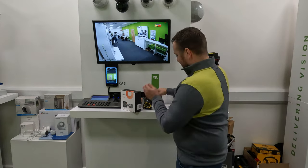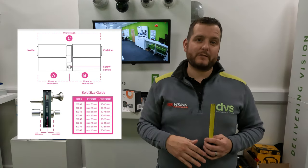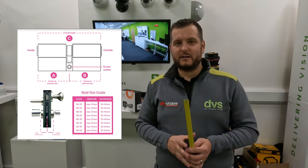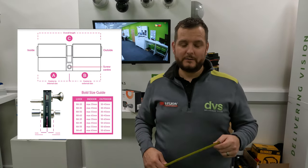The first thing you need to install this — and this is the best bit — is a screwdriver: a Phillips and a flat blade, not much more, and two hands preferably. You also need a tape measure to measure the lock before you buy the one that fits your Euro cylinder. Euro cylinders are available in different sizes, we stock them, and if we don't have them we can get them pretty much next day. Measure the lock — I'll show you how shortly. That gives you your lock size, then you buy it, take the old one out, slot the new one in, put the centre pin back, use the app to program it, and it's as easy as that. In about five minutes you should be up and running.